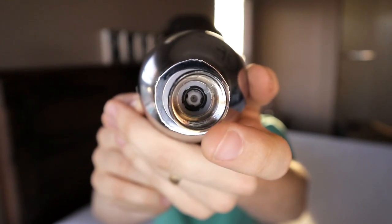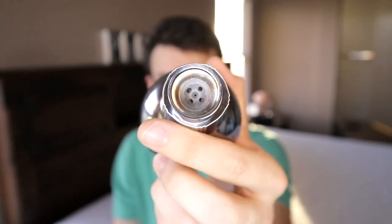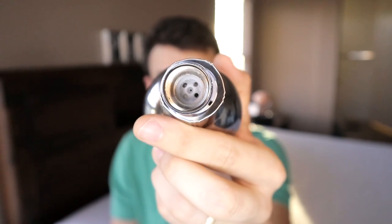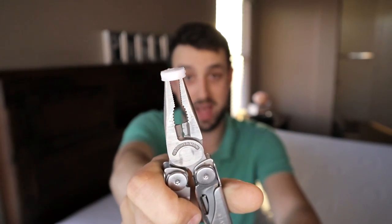For the second step, I'm going to gently pry out the black o-ring in the middle there. Here's the black o-ring. And this is the actual flow restrictor — it looks like a white button. You can use a screw to pull it out or pliers. Here is the flow restrictor — it pulled out easy with some pliers.